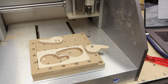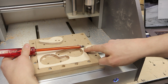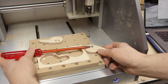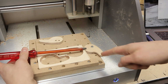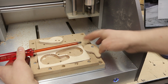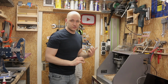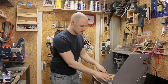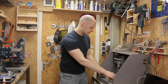As you can see on these ones, if you draw a line between the point of contact on the wood and the screw, there's always very little distance. So here, the point of contact on the wood is here versus the screw here. That's good. This clamping method with the defined 0 is really cool if you want to do quick repetitive work that doesn't take a huge load. Because I found with aluminum it might loosen after time with the eccentric clamps.